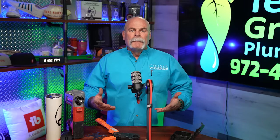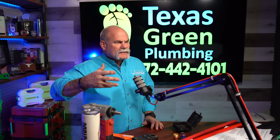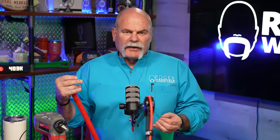That's the most important thing to remember about PEX pipe. Number one, know what size you need. Know what pipe you need. Know what the installation is for — is it potable water? Hot water? Cold water? High-chlorinated water? Make sure you get the right stuff. There are more than 20 different manufacturers of PEX pipe out there, so look at your particular application and do the homework on what's going to be best for you. Here where I'm at, we use PEX for potable water — no radiant heat systems. That is why I prefer PEX-A with an expansion fitting. Know which manufacturers make which types — that's the big tip that can actually help save you from having a problem.